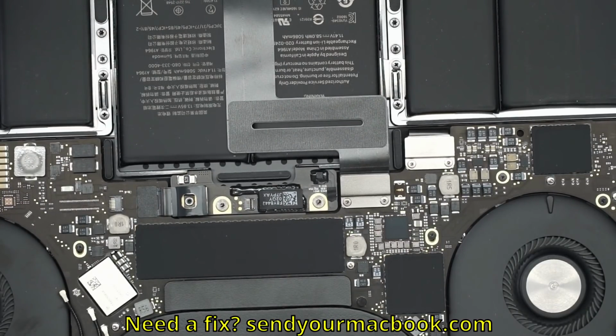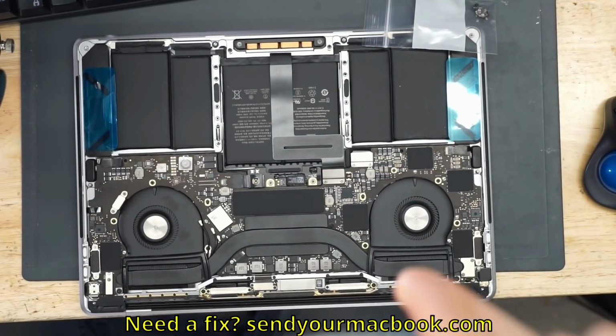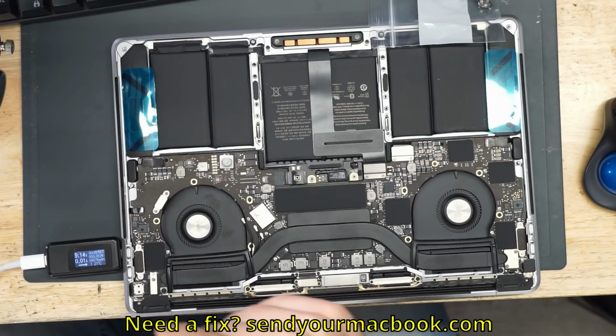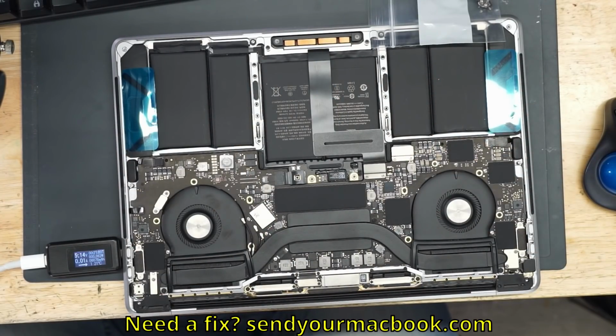So first thing that we always do is we unplug the battery, and then we plug in the charger so that we can get an idea of how much power the board itself is taking, because that often gives us an answer as to what our problem is. Once you've spent 2 hours trying to fix a problem and you finally figure it out, it makes sense to take a basic little peek around and see what the board was doing beforehand, and then make an association. Okay, so when the board is doing X, the problem is Y. You make a nice little table like that for yourself.